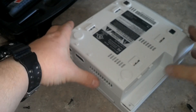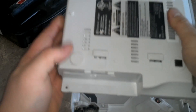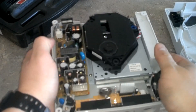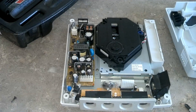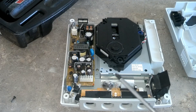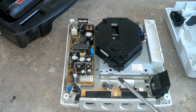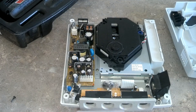They're still releasing games for the Dreamcast — I forget the name of the company, there's an independent one that's released about four within the last several years. Alright, this is the CMOS battery right here. One night I just went ahead and put in a regular watch battery — don't do that. It's not rechargeable, and the Dreamcast tries to charge it, which can overcharge it, cause problems, maybe even create a fire.